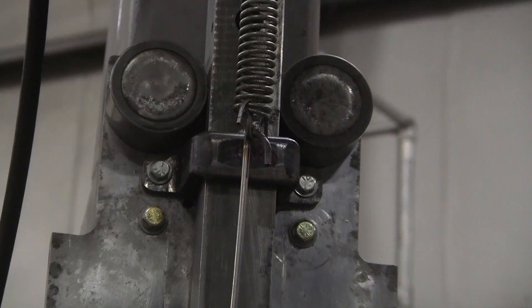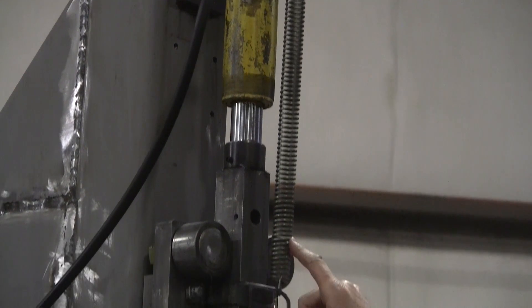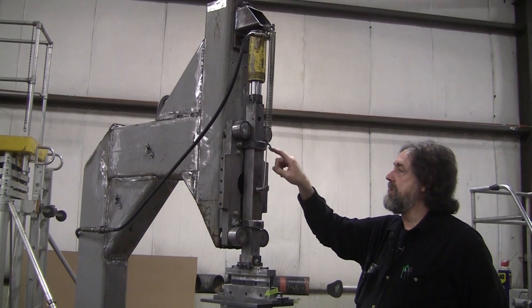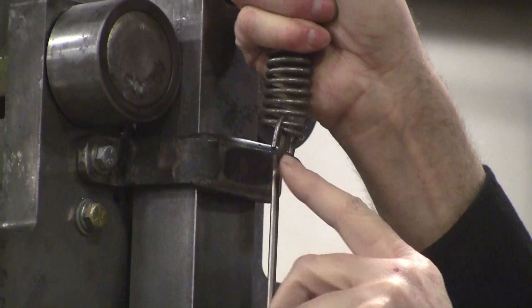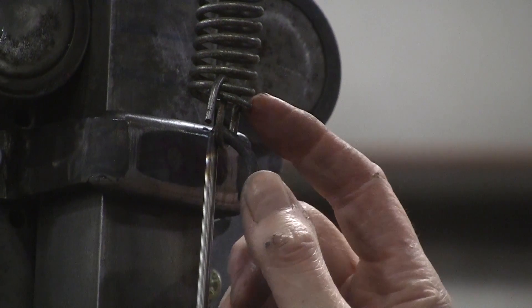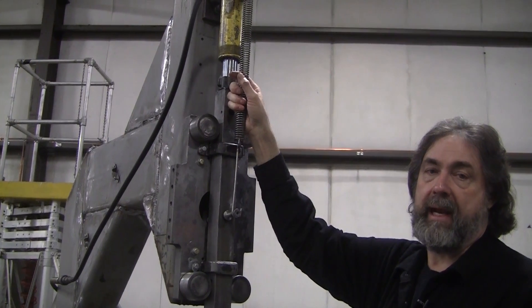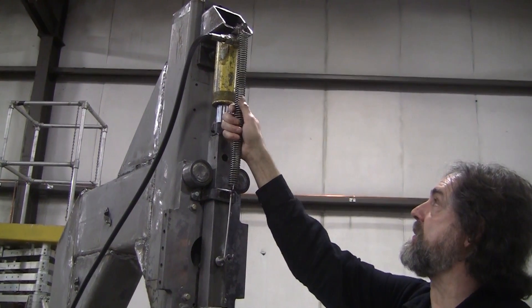I was at the scrap yard about 25 years ago and found a nice spring where one end's loop was broken off. But somebody had made this little wound wire deal. It's just — I think — three thirty-seconds welding wire, or maybe eighth-inch wire. You bend it up really easily with a pair of pliers and just twist it in. It's much stronger than an actual loop. I use that trick a lot on springs — when a spring end breaks or you need to adjust the spring, cut it off and put your loop wherever you want. It's a nice little hack that works really well in the shop.